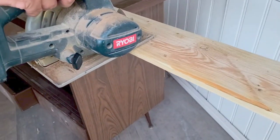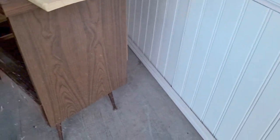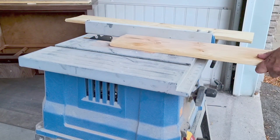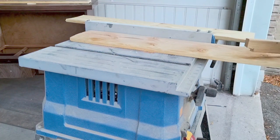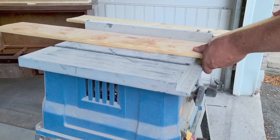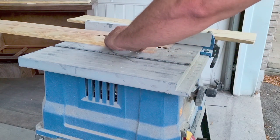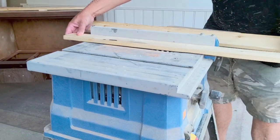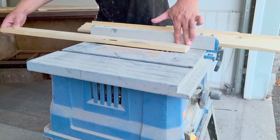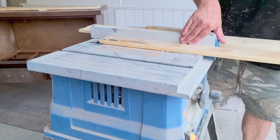Here's the part you've probably been waiting for — the wood panel doors. I wanted doors on this piece, so we measured out the width of the panels. Always measure how wide you want the door panels. We're cutting the length of the two long pieces, then you need two short pieces for the width. Always make sure you have a little bit extra on the ends so you can trim later, because if it's too short you have to start over.